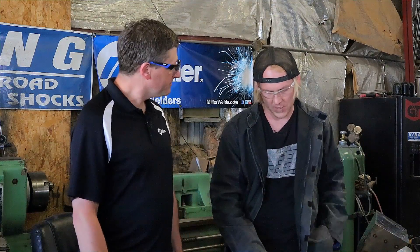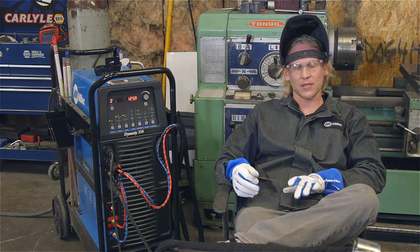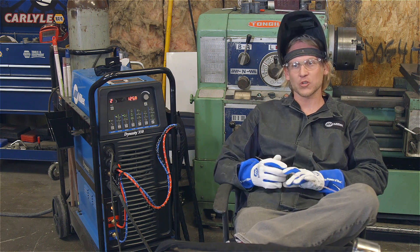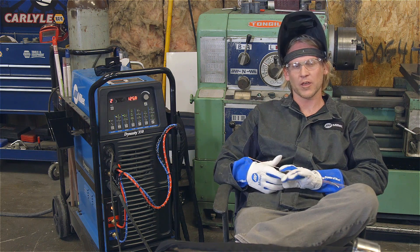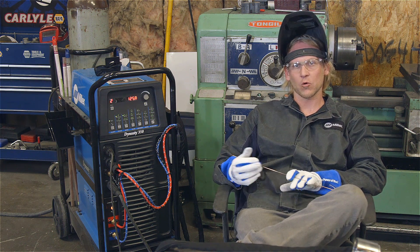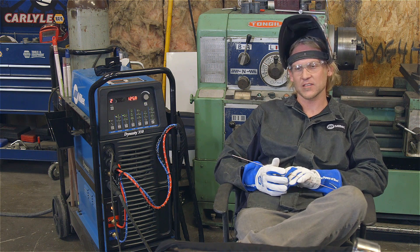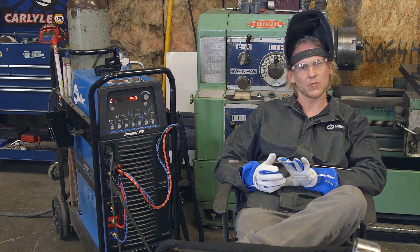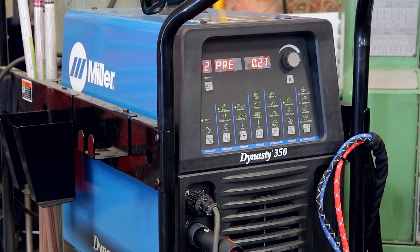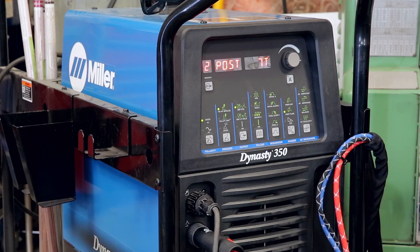Fantastic, let's show how this thing's welded. 90% of the work we do at Battle Born Engineering is TIG welded. We use the Dynasty 350 on absolutely everything. The machine has a ton of versatility and a lot of adjustability — you can do anything you need to do in the shop with this machine. I typically like to leave the machine at 250 amps because that's about the maximum amperage range we weld with, but I would suggest for intermediate and beginner welders to dial in the amperage to the work thickness you're using. Today we're welding some inch and three-quarter 120 DOM. 125 amps would be close to the starting range before the material is hot. Obviously, as the parent material starts to get hotter, I'm going to use less of that amperage — I would assume that most of it will be right around 90 amps. I like to set the preflow at about two tenths of a second. It's not much — just enough to purge the gas out of the line and get a nice area of coverage started before the arc lights. You'll notice my post flow is a little low for the amount of amperage I'm running. Industry standard is typically one second per 10 amps; I typically leave it at seven.